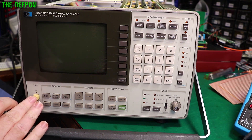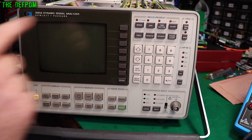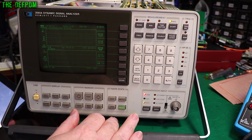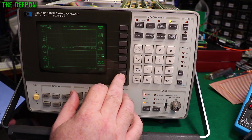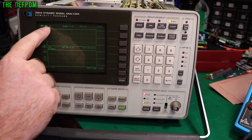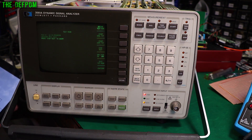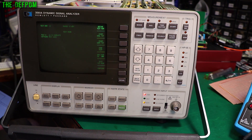This is another keyboard testing stage. I've put the cards everything back in again so it's all fully complete. I should get that 11.00 error again. So you have to go through test mode once more — it says front end programming error detected. So you do preset, mode, test select — now we know where it is — define test number, which is that top one. We want test number 12. Enter, then start single test. Test 12 is complete — no error codes. Test E is complete. Test F is the next thing, so that stage is finished.